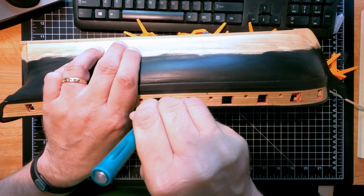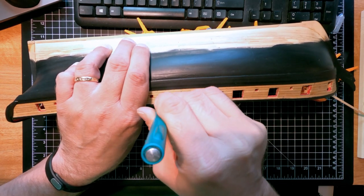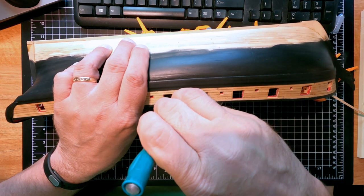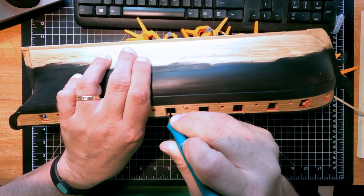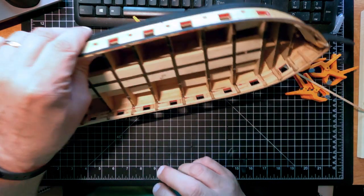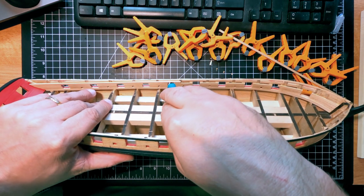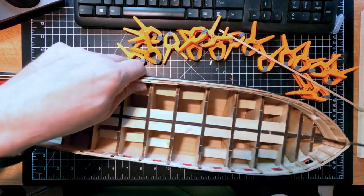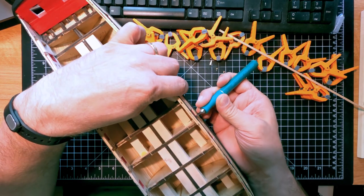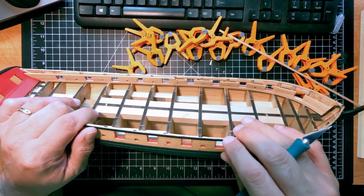Start shaving it away. There's the plank that goes over the edge — same on that one. Now you start cutting into the top plank and just start carving it away. As you do that you'll get it right in where you want to be. Don't worry about carving too much away. If you have to shim the top of it to get the red line back, go ahead and do that — I'll probably do that on this one since it took a little bit too much out. But when you look at the inside you can get a nice straight edge. Touch it up — this right here needs to be touched up a little bit to get a nice straight corner. Keep doing that until you're happy with it. Get a little file in there, sand it, whatever you have to do — get your nice straight corner.